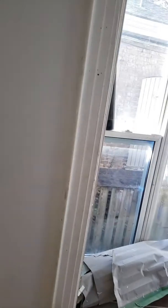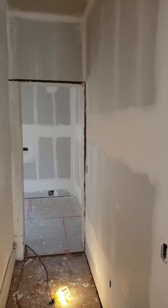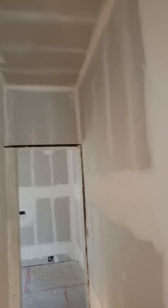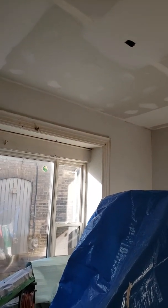It's looking good. We just have to wait for it to dry — it's going to take a couple of days. All night tonight and all day tomorrow, then the next day I'll be able to come in and start pre-sanding and the skimming process. It'll probably take me almost the whole day to pre-sand this whole house, especially with the skim walls and the new drywall. I'll pre-sand everything — screws included, angles included — everything nice and clean and ready for the finishing process. Tomorrow I'll just touch up any low spots, like that tape over there, give it a quick load. I'm going to move a lot of this stuff into the back closet in the kitchen so it's out of the way and I can mud and sand without getting dust all over their stuff.